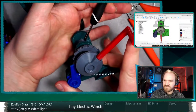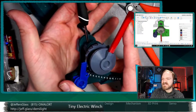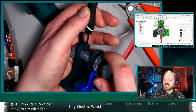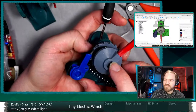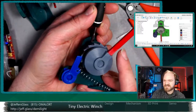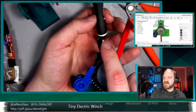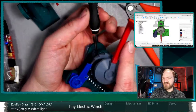You can sort of see those two parts moving together. What's happening is as I rotate this handle counterclockwise, I'm slightly unscrewing it from the barrel thread, and that's causing there to be less friction here. At some point, this barrel will slip. But when it slips, remember, that's attached to these threads, so when the barrel slips backward, it actually tightens this thread a little bit, and so it stops moving. So the lowering process essentially is a continual action: this rotates counterclockwise, loosens the thread, this load causes the barrel to move, which tightens the thread. Loosens thread, tightens thread, loosens thread, tightens thread.